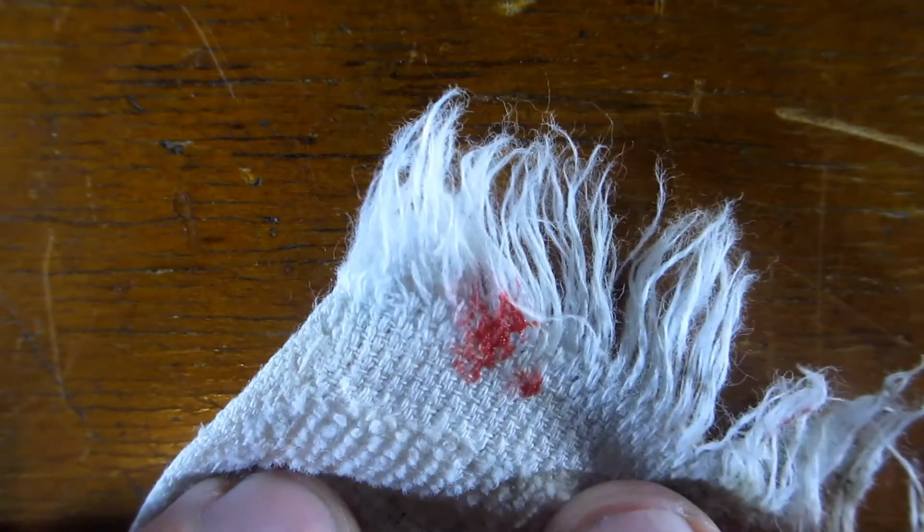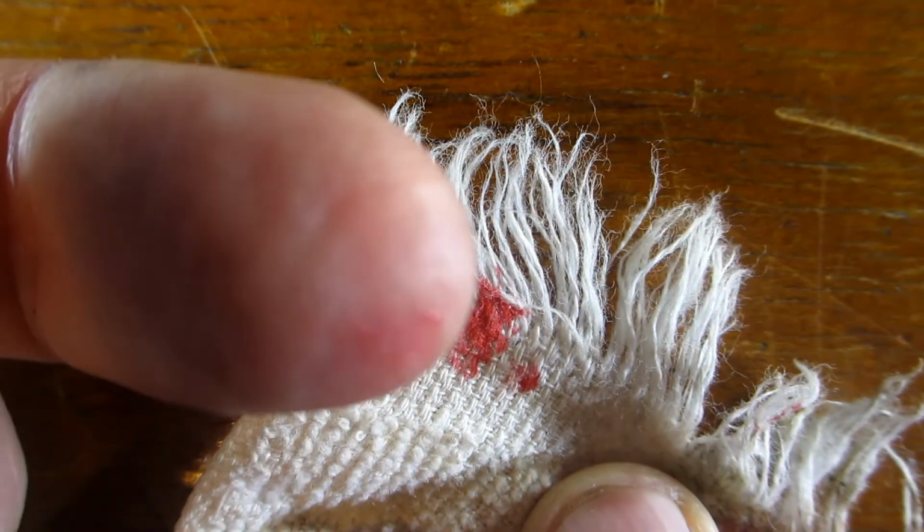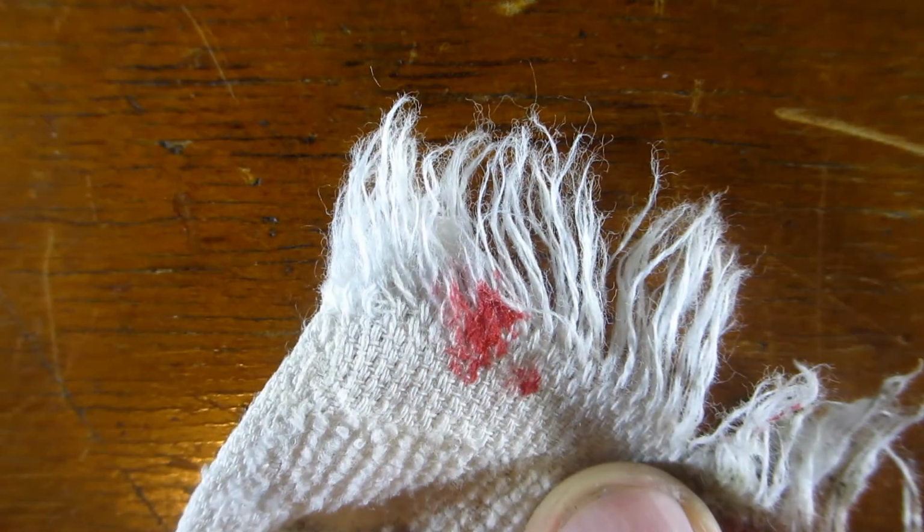Just on a side note, this red SMD glue is still wet after 7 days, so it looks like it doesn't cure unless it's in an oven, at least not very fast.